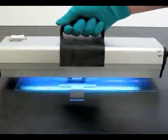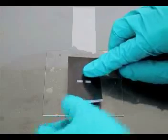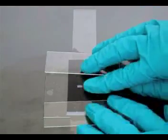Finally, we apply the UV light. When the first polymer is done curing, it is rinsed with water and acetone to wash away any excess uncured polymer. At this point, the second polymer is applied and the patterning steps are repeated. This process will yield multi-material planar structures that can be used to make functioning robots.